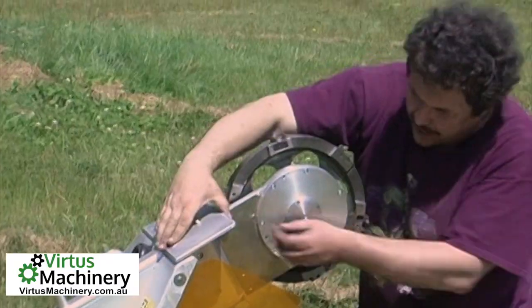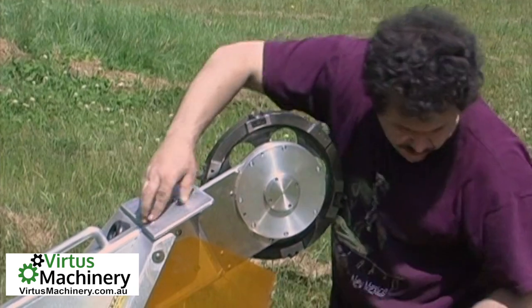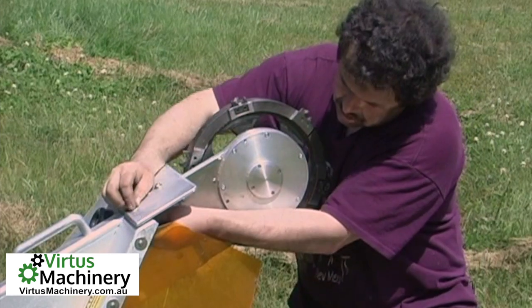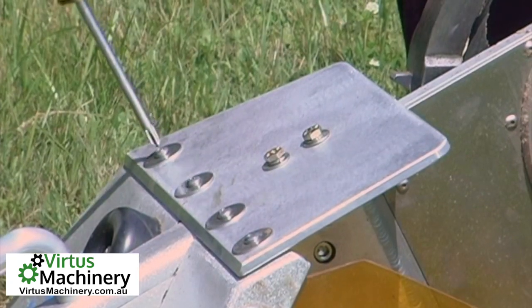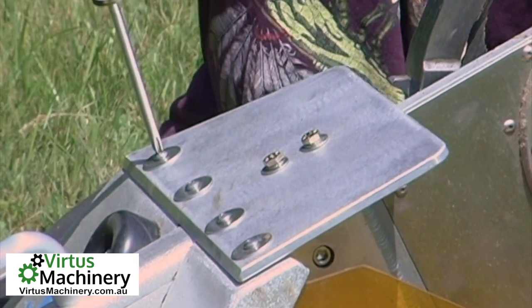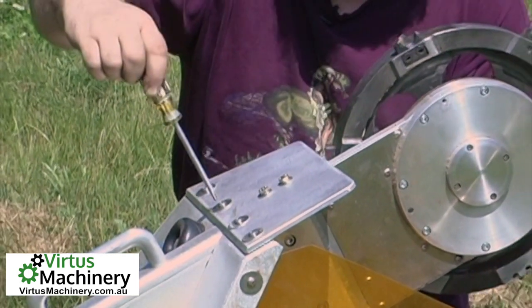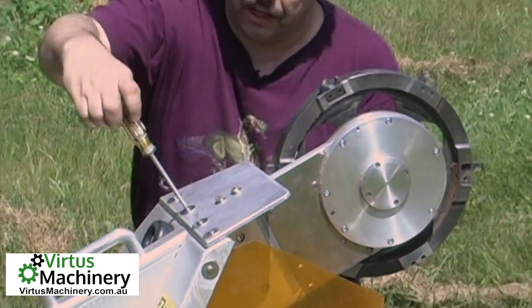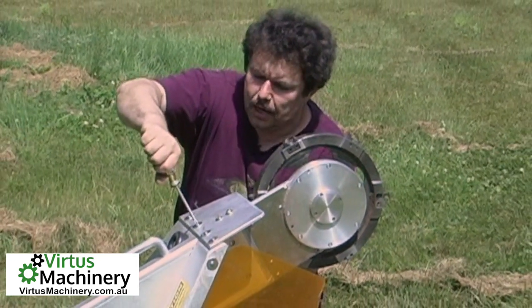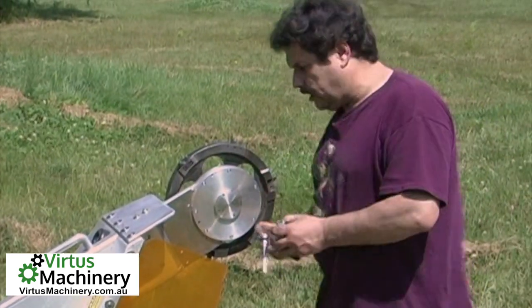Remember, when you're putting the guards back together, there's going to be the screw and a washer on one side, and then a washer and a nut on the other side, sandwiching everything together. When you're tightening these bolts up, you don't have to really hit them with a 3/8 ratchet. Just snug them up. They're small screws, and powerful guys can break these bolts off if they tighten them hard enough, and it's not necessary. The nuts have a Nylock insert in them, so all you want to do is snug them up, with maybe 10 or 15 pounds of torque. That's all it needs.